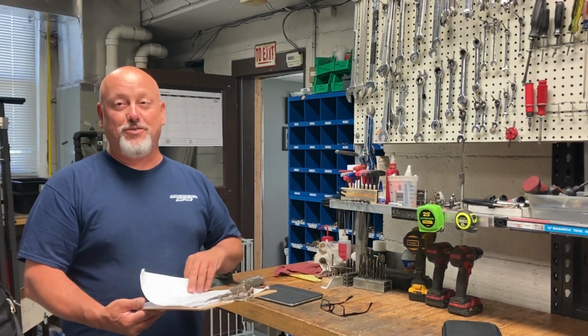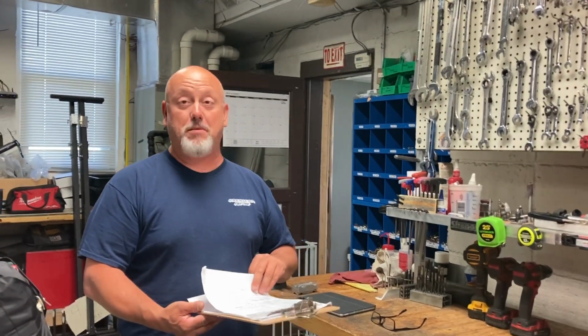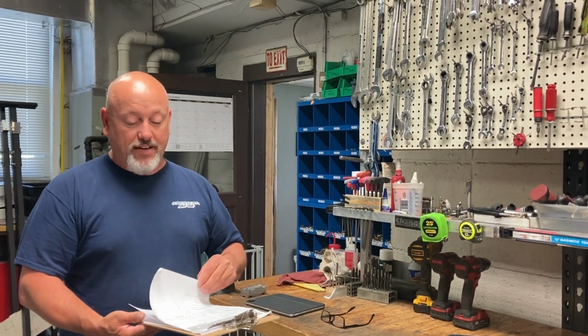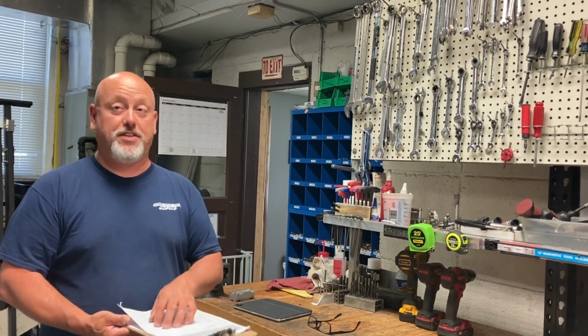We started out a couple of years ago with like 4 pages, and I keep coming up with stuff. Shelly comes up with stuff. Travis comes up with stuff. And we keep adding to the list. We even have a spot for check torque converter spacing, and we write down what the spacing is. A spot to make sure we bleed the brakes, so nothing gets missed.